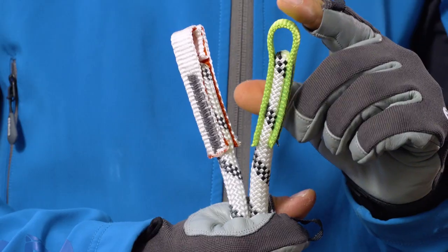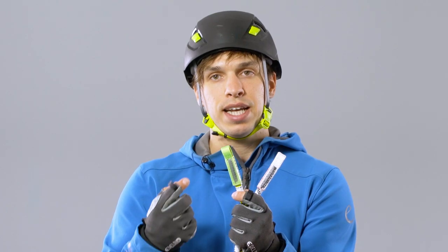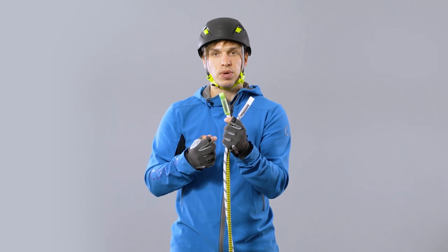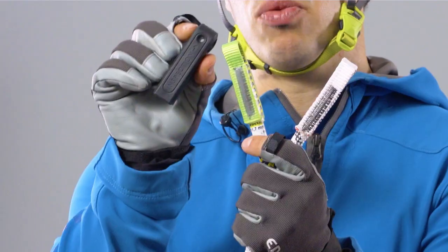With the Weplink, a narrow polyester or Dyneema tape is sewn to the end of the rope. The resulting end termination is protected against wear by either a shrinking tube for our arborist ropes or a rubber protector.